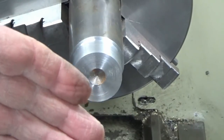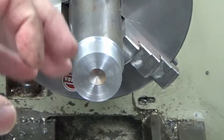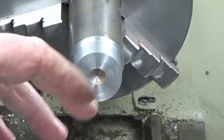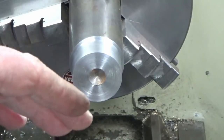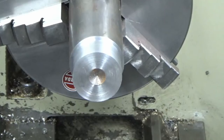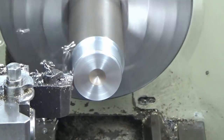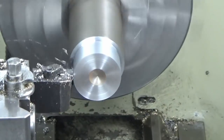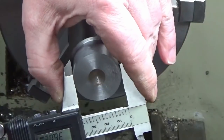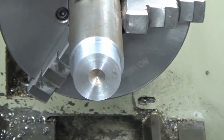So we're aiming for 30. So we're going to get this down to 36, and then from 36 in, I know I've got 6mm to come off, so 3mm a side, and I can choose the flavour of those, but certainly the last three or four cuts will all be the same size. And that's balanced cuts, and we'll get to that bit. So we'll get the 1.5mm off now. So that should be us at 36. Yeah, we're 36.01 with a vernier, so I'm happy with that.